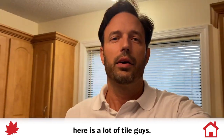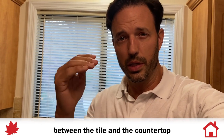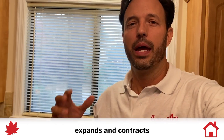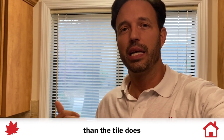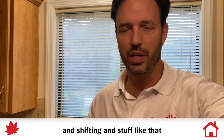What's going on here is that a lot of tile guys, when they're doing tile in the backsplash, are going to use the grouting on the tile and grout the joint between the tile and the countertop to make it pretty. But what happens is that as the countertop expands and contracts — when it gets hot, when it gets cold — it expands and contracts at a different rate than the tile does, and that creates a separation. There could also be other variations like settling and shifting.